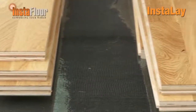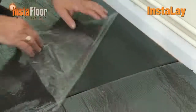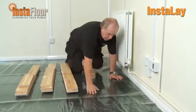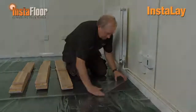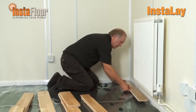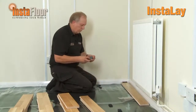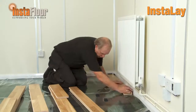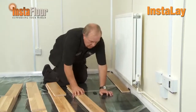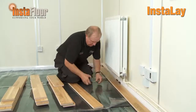I've assumed you know how to fit wood, so I've already scribed the boards to the wall and cut them to follow the contours of the wall. Taking the wider flap, we turn back a small triangle on each corner of each run of underlay. This is a very high-grab pressure-sensitive adhesive on the underlay, which is very important when installing wood because we want good contact between the wood and the underlay. We position the boards using wedges to ensure we keep our expansion gap, which is important with all wood products — we place wedges along the wall to maintain a consistent expansion gap between the wood and the wall. Always follow the manufacturer's instructions for the size of the expansion gap, as different manufacturers require different gaps.